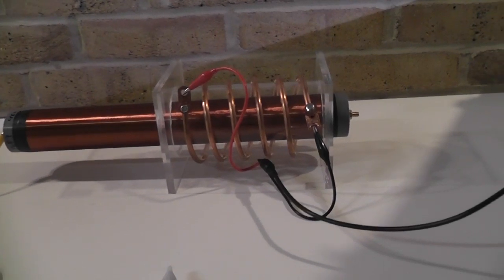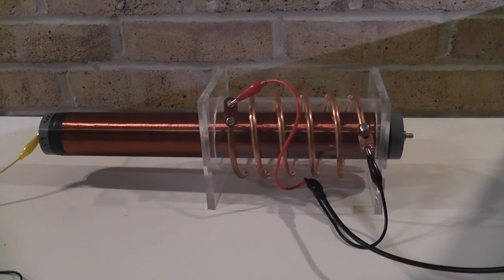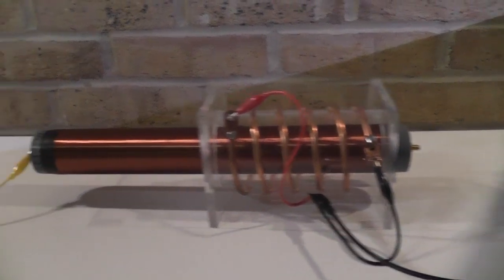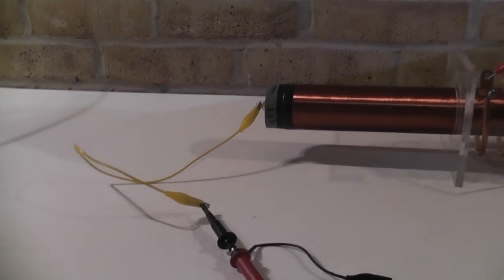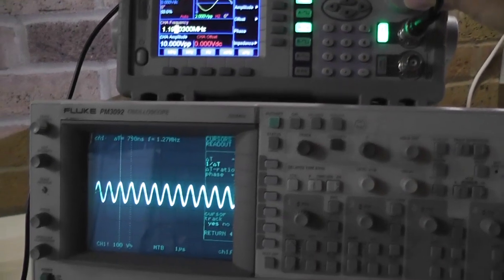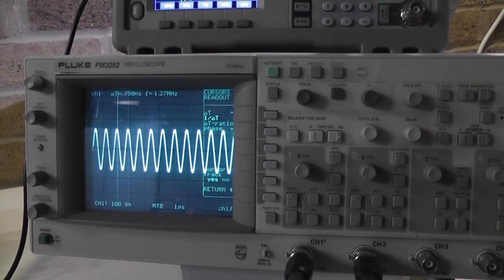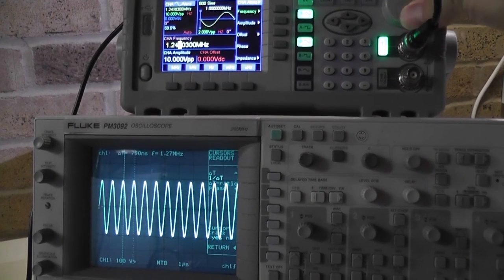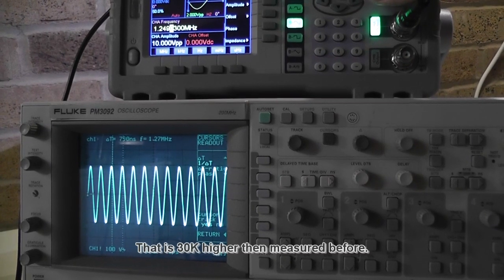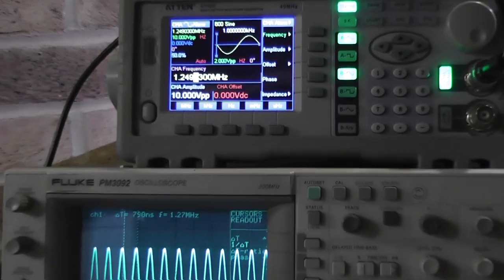So now I take it to the next level. That means I'm going to drive the primary — no top load, nothing — still the secondary in place. I would assume it should resonate at the same frequency, but there might be a small difference. Let's have a look. I have the oscilloscope directly connected, which might have a small influence as well. I'm here at the moment at 1.199 MHz — going up. We had 1.220 MHz. I get a higher peak, the most peak here at 1.249 MHz. So slightly higher when connected.